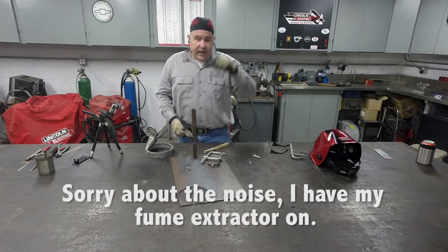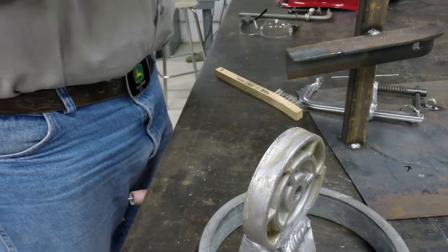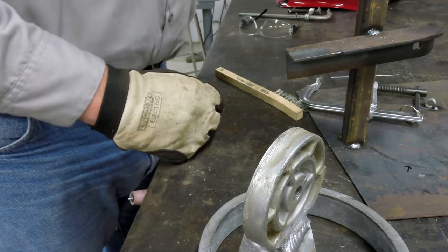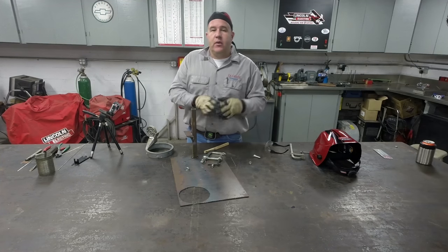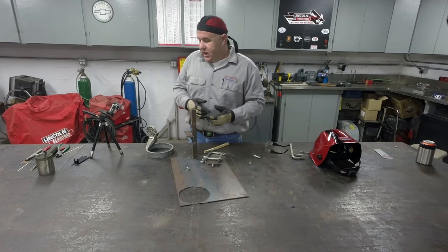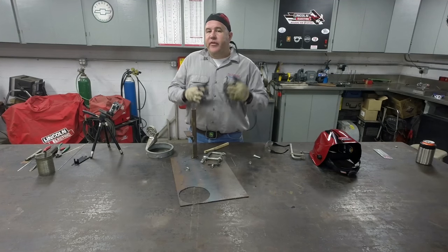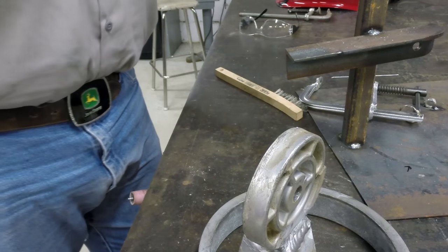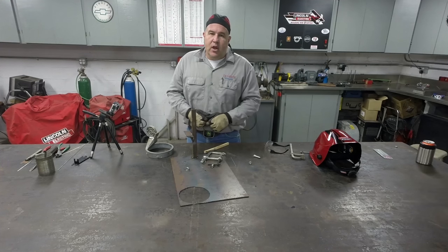Okay, good news — it looks like it welded fairly well. Next step is going to be to take a grinder or a rotary burr and take a good portion of that weld back out. We'll probably do it one side at a time so that it stays located and we don't take a chance of grinding all the weld out. We'll come back and re-weld it one more time — this time hopefully a lot of the impurities are gone. I'd still like to grind it out and re-weld it because it's a very small part and it's not going to take very long.